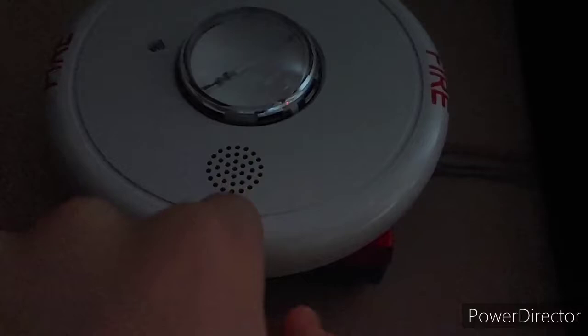This is on temporal 30 candela, the other one's on 15, and then the one in the closet is like 0.27 or something. Same detectors and push station. Yeah, so let's get to the fun part of setting the alarms off. Wear hearing protection, kids. This is definitely gonna be loud because it's a Genesis and a Wheelock AS, so you know it's gonna be up there.